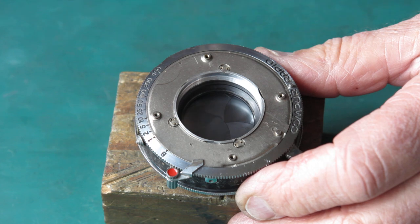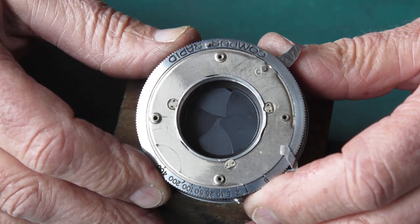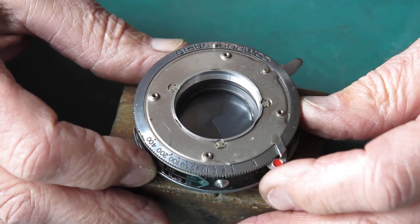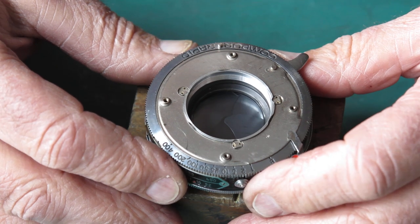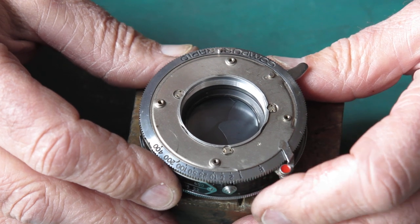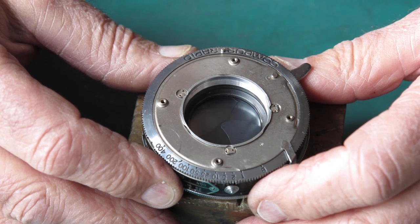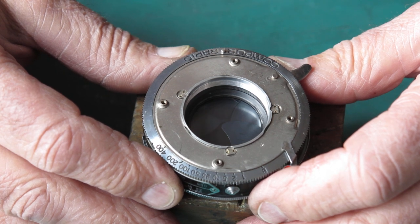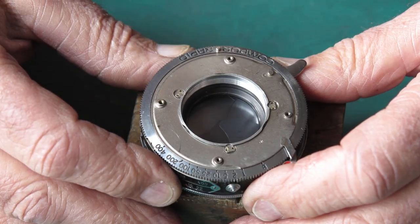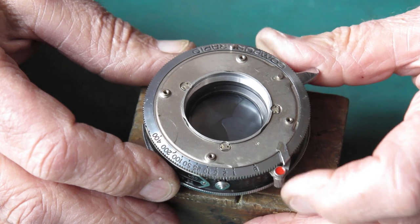So I was left scratching my head, and I thought, well, I had to look further afield, and I remembered something. When I was looking at the main lever, I described the bird paw on the back of the main lever, and the head of the bird paw, that's where you put some lubricant on those points, and I said that the tail of the bird paw was distorted. And I said that I didn't want to change the shape of that to square it up, because it might have been like that for a purpose, as occasionally things are. But I remembered that bird paw, and so I had a look at it and thought about the symptoms and straightened it up. And lo and behold, the shutter worked fine.